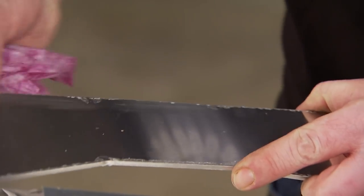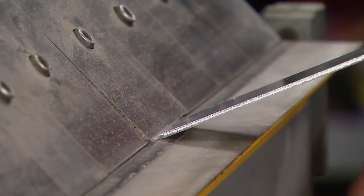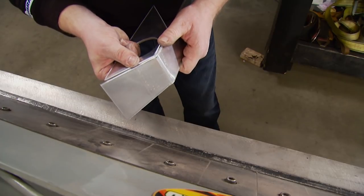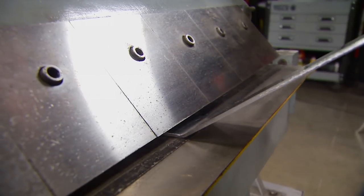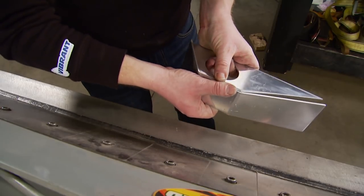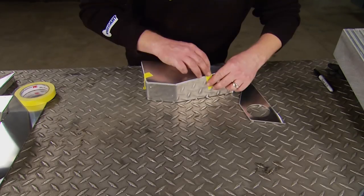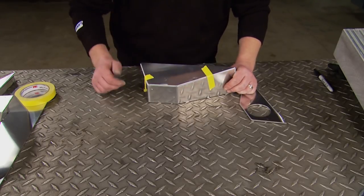First thing, I'm going to clean all this aluminum up and get all the residue off of it. The cleaner the aluminum is, the better it's going to weld. From there, we're going to take it on the finger brake and bend all the pieces to form the intercooler tanks, top and bottom. We don't want to move it too far or bend it too far, because then when you try to bend it back, it creates a ripple in the aluminum and it doesn't look nice. For the ideal fit-up, you want a nice groove to make sure you get a bead that's evenly spread along each surface.